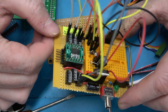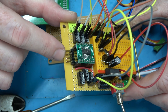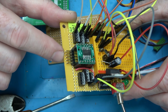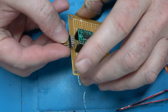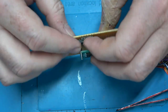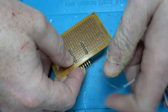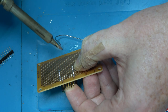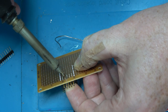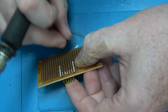And then this header here looks kind of big, but the reason I have this is I need this for the ICE programmer. Really, you only need three pins: power, ground, and the UPDI, the Universal Programming and Debugging Interface. The other thing that's nice about these new ATtinies is they have better peripherals than the old ATtinies, the classic ones, like 25, 45, 85. I believe I made a video about this, but since Microchip owns Atmel now, these chips are like a hybrid.